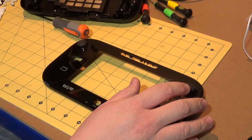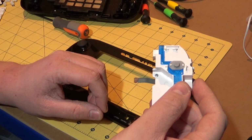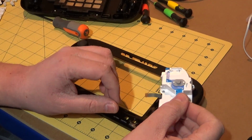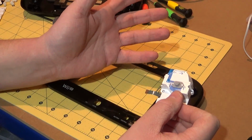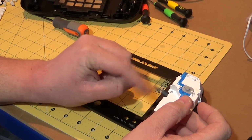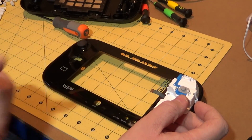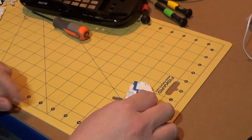So one of the first things I'm going to need to do is make some breakout boards for these flat flex connectors here. So I'll just make a small PCB to which I can mount the flat flex connector, so that I can just bring it out to standard 0.1-inch pitch pins, and then I can start prototyping and breadboarding stuff. So that's one of the first things I need to do, is go off and make some prototype boards for that. What I'm going to do to try and help facilitate that, though, is, I think I mentioned this earlier, I'm going to try and measure the pitch